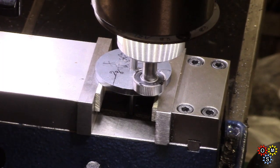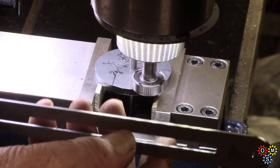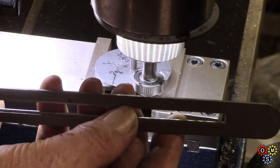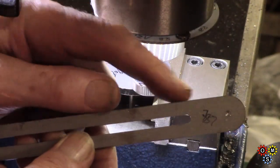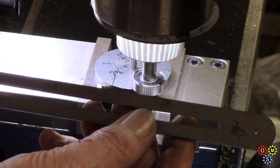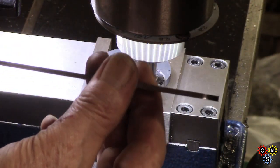A little bit of explanation here. We got this milled to either side. As I said, it was laser cut. I discovered after the first cut that the remaining side disagreed by about 9 thou, so I had to set that up especially to get parallel. We're now good, I would say, to half a thou.